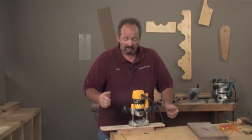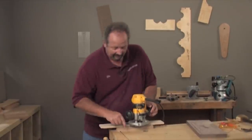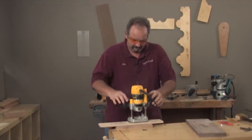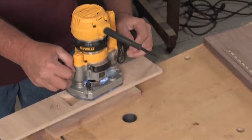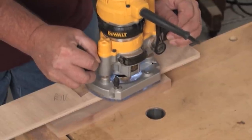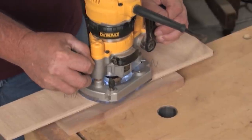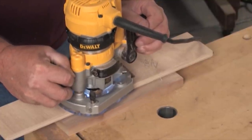You also want to make sure that your depth of cut goes through your inlay. Just to check that, I'm going to make sure that my router bit gets clear down to my sacrificial piece — which it does. So I'm going to start right in the corner and slowly work myself all the way around the perimeter.